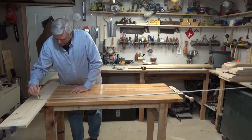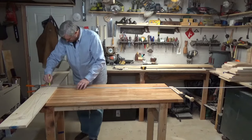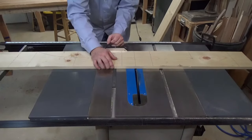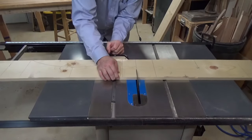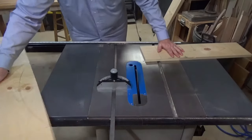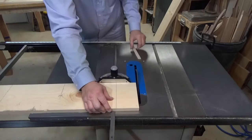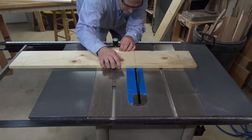To check it out first, I'm leaving four inches of a square end on each end of the valance, so I want the arc to fit into those two four-inch measurements. Now we're just cutting them to size — a bunch of different sizes: 27 inches, 30 to 31 inches, another at 50 to 51 inches, and I think I had three of these at 27 inches.